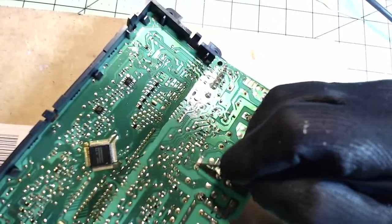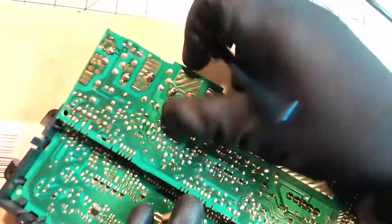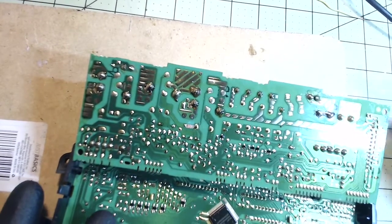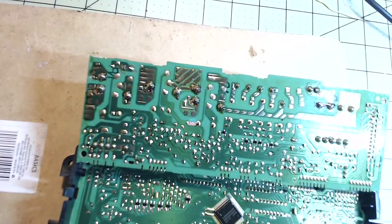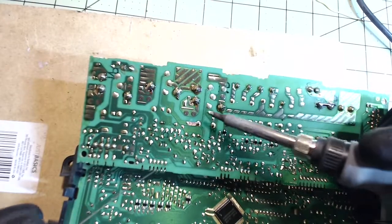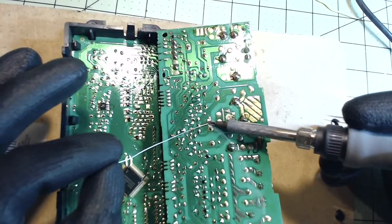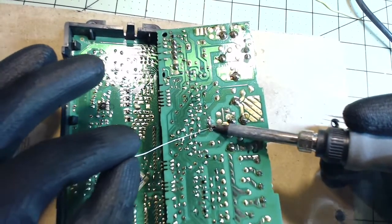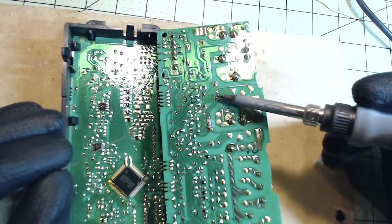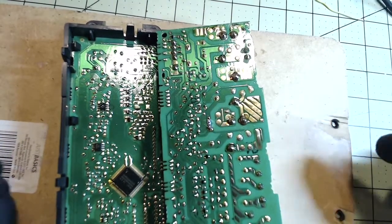You've got to do it for a bit — you can go kind of sideways like this, but enough to where none of the green is showing anymore. You can see that's good. So I'm going to take my isopropyl, clean it up, make it shiny. Now all we do is once you've got your new relay in, heat it up — you can see you can make a nice little bridge and go as far as you want, basically making the solder on top of that trace. Now your solder is going to be the new conductor instead of that burnt trace.